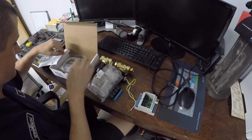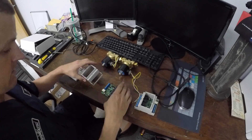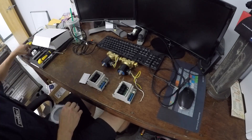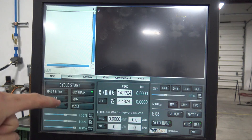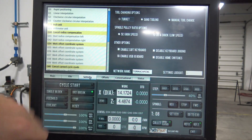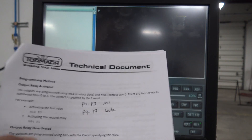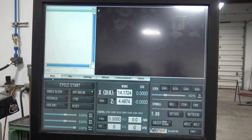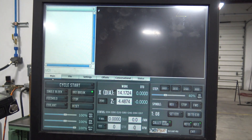We got our circuit board and a little case — throw this together. Plug in our device via USB cable and you see the lights light up. In PathPilot settings, make sure you have 'Enable USB IO Board' checked. There's one little glitch: this thing was really meant originally for the mill, so the instruction manual says to use P0 through P3. But on the lathe, that's P4 through P7. No big deal, but the instruction book doesn't say that — which it should.